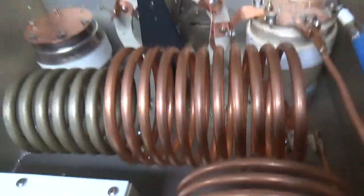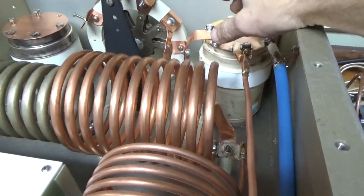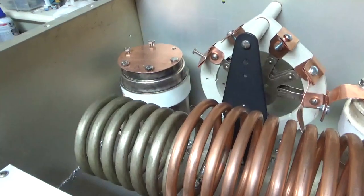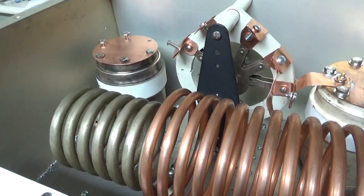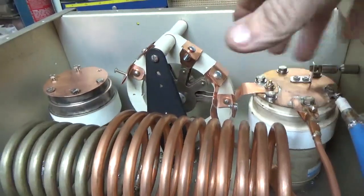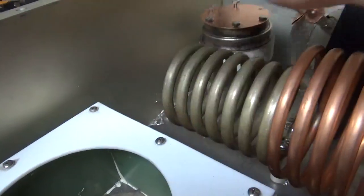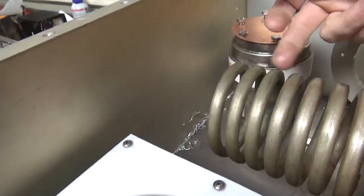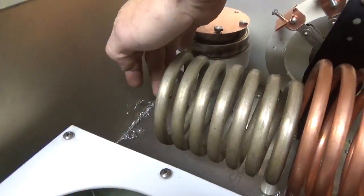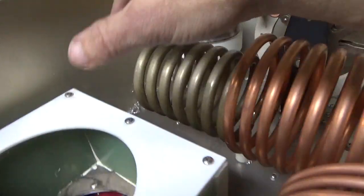I have like three more of these caps, so I'm going to have to map out the capacitance-to-turn ratio and write it down. Before I connect that to anything — the plate side — I'll do the same thing. I'll have to put some turns counters on the front, temporary ones. They'll be in their final positions, but I need to be able to adjust the plate and load, and output capacitance. I'm going to put the plate block over here and install the tube.